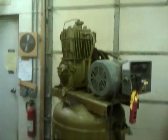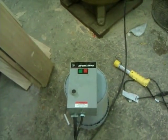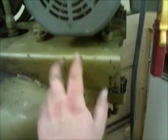I got my Quincy compressor today — I did buy it and just got done converting it over to single phase, well partially. I'm not complete yet. I need to do a couple things. The one thing I haven't done yet is I need to get another contactor. The one I have here is a spare for a different application, but on surpluscenter.com they have a 5-horse contactor in an enclosure made by Siemens. I need to tie that into the motor and hopefully mount it in front of the motor.